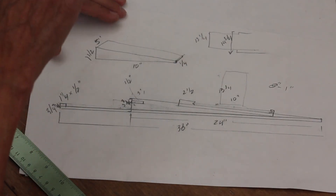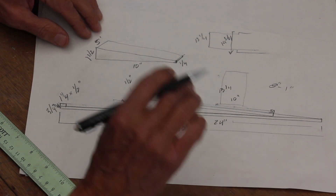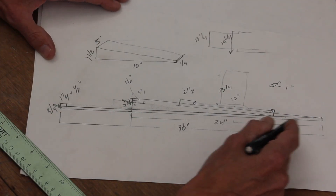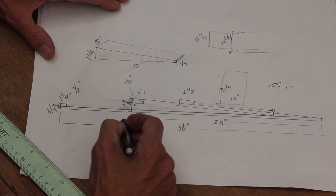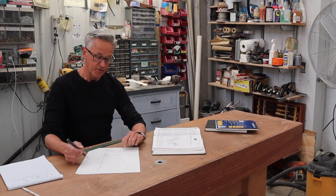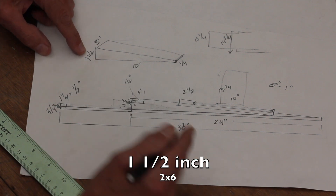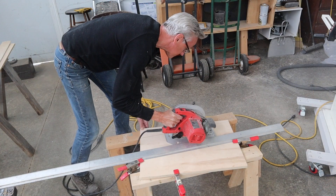The first thing I decided was to use a one-to-eight slope on the scarf, which is very common for half-inch planking. I'd use three-quarter-inch material for the base, cut some plywood for the angle, use hard maple left over from another project for the router carriage rails, and cut the wedge out of some half-inch material. The first task is to cut out the plywood pieces and get started.